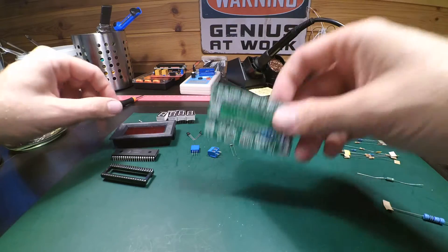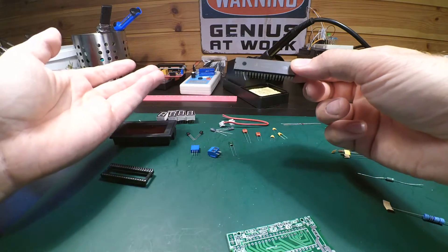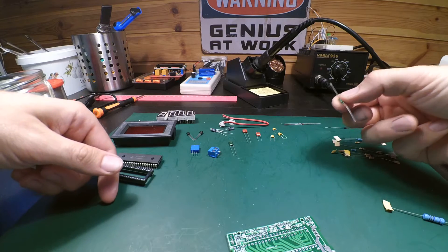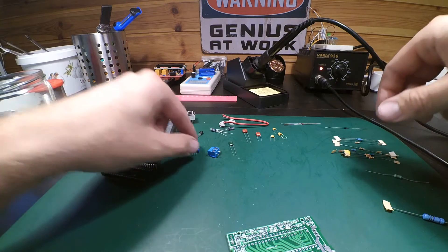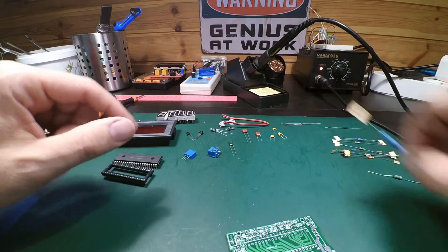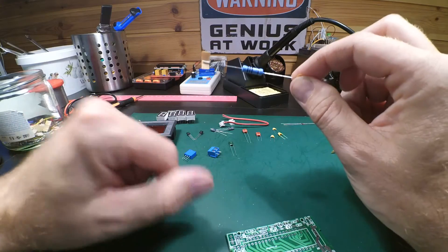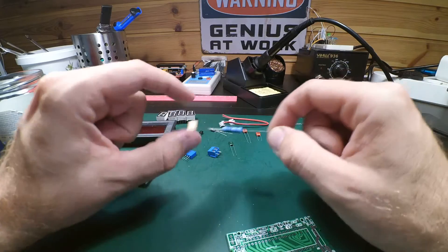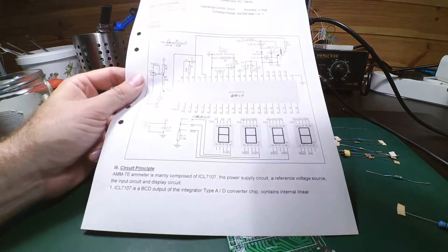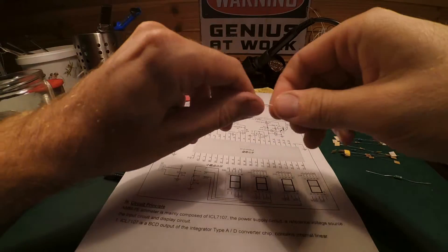Just look at the parts to bring it. It's based around the 7107 - a pre-made chip which does all the hard work. You're going to look at the schematics. Normal components: a bunch of resistors, a choke or inductor, a precision multi-turn potentiometer to set some values, a transistor, a voltage regulator, and the main attraction - a large resistor but a very low value. This is the shunt for measuring the current. I've put a link below to the kit and there's also a manual you'll want to download.